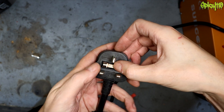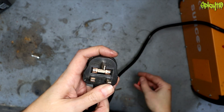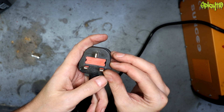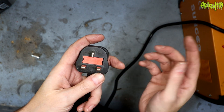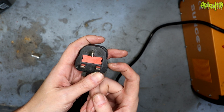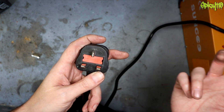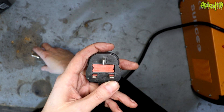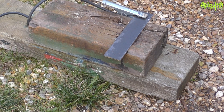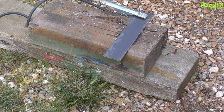What I'm going to do is put a normal 13-amp fuse in this machine and go outside to do some test cuts on a piece of steel and see if it blows the fuse. If it does blow the fuse, it tells us the machine is prone to doing it and rather than fix the issue the company decided to do that. Sorry if the audio isn't quite as good for this part — let's see if I can even turn the machine on without blowing a fuse.